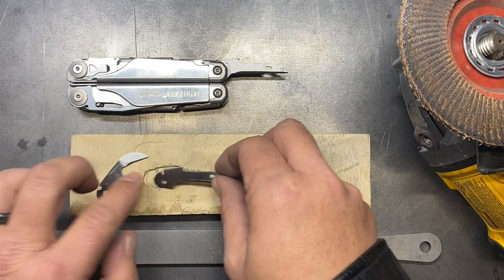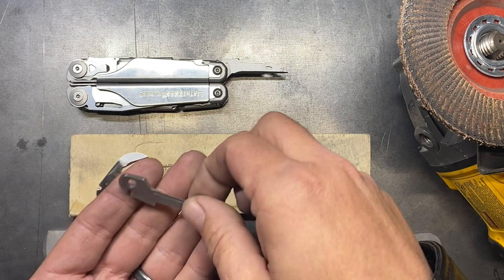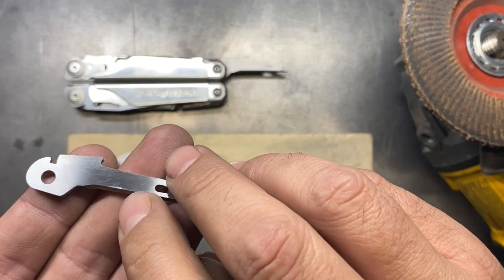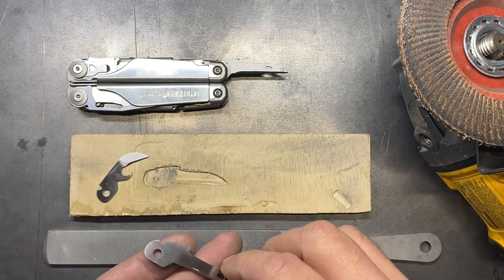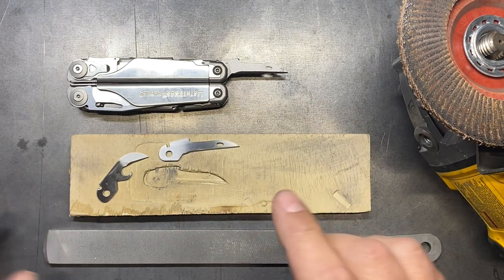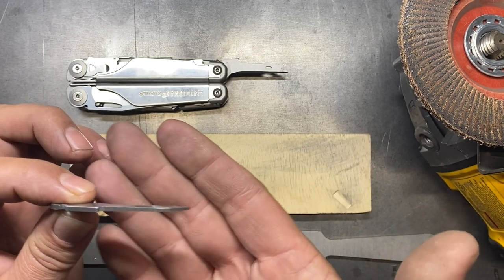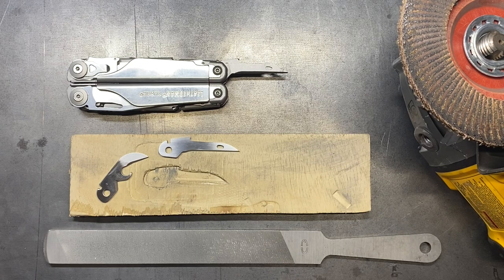This one ended up working out pretty well. I just profiled this side of the awl. On the other side, I just did a light sand of 220 and it really came out well. I did end up with a little tiny scratch mark that came from the grinder where I went just a touch deep, but I might still buff that out a little bit more. I ended up taking out about 15% to 20% of the material, so this awl is quite a bit thinner than what it started out originally, and I think it's going to work better, actually.